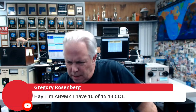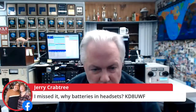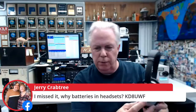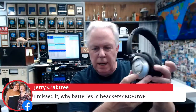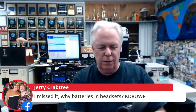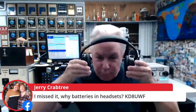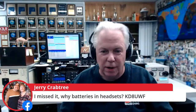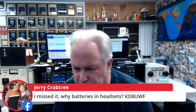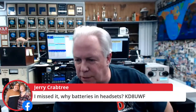And let's see, Jerry says, I missed it. Why are there batteries in the headset? Well, there are batteries in here because this is a noise canceling headset. It has little microphones out here on the ends, and it actually introduces the noise 180 degrees out of phase. And so when you put these on and you turn them on, and that little green LED comes on, I can't hear myself talk. It's that good. And that's really important when we're doing these big multis here, because there's so much noise, it would drive everybody crazy.